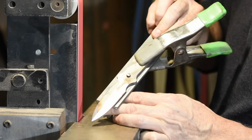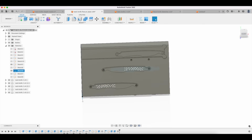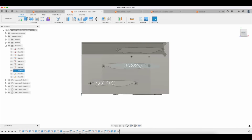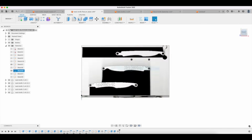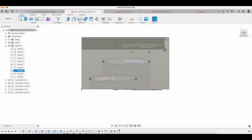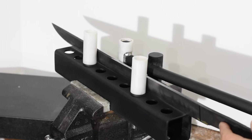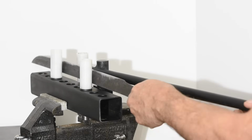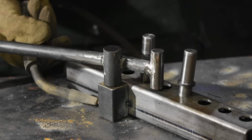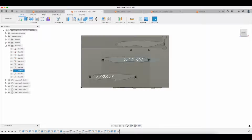And so that's just the kind of thing you've got to think your way through when you're deciding, oh yeah, I want to make X number of these. Is it worth making? Is it worth spending all this time? And again, this is CNC specific, but there are perfectly valid reasons for making fixtures to put on your manual mill or your drill press or whatever. But fixtures take an enormous amount of time to make, and so you always have to be thinking your way through in the design phase. Is a fixture going to help me out here? And if it is, how many of these am I going to make? Is it worth the effort of making that fixture?